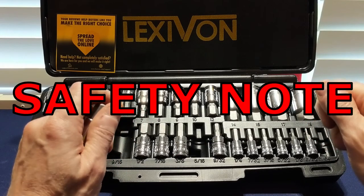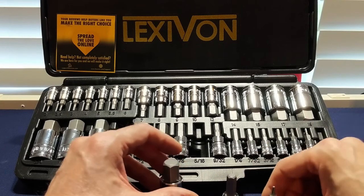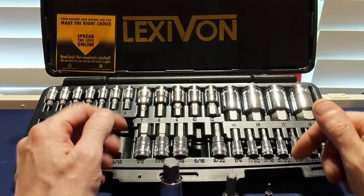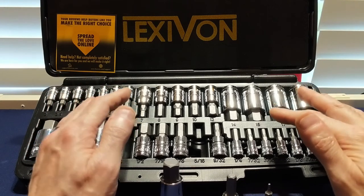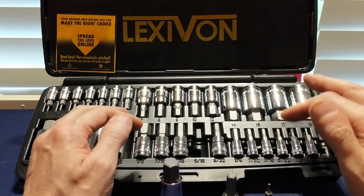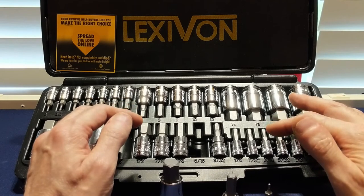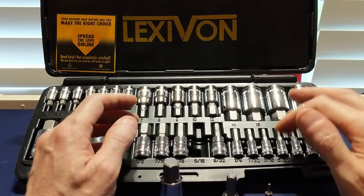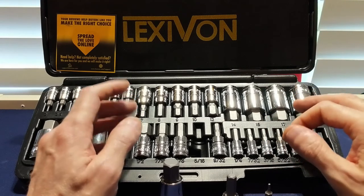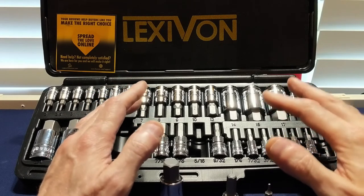Safety note: S2 steel is harder and will show less signs of wear and tear, but tends to have less ductile strength than chrome vanadium or 8650 steel. It is more expensive to produce and is therefore used by fewer manufacturers, most frequently for screwdriver bits and two-piece socket bit sets. However, none of the bits in this set are impact rated, nor were they designed to be. I would not use these in an impact driver, especially without proper PPE, as they could have a tendency to shatter. Please only use impact-rated tools when needed — chrome vanadium, chrome vanadium molybdenum, or Protanium steel for the best of the best.